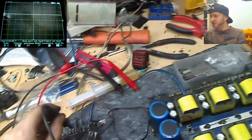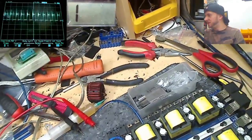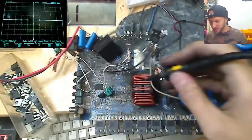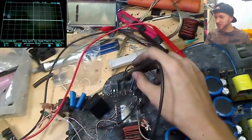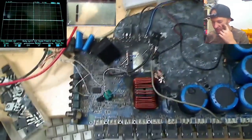Low side over here, amplifier coming on. Oh shit! It is switching! No way. It's very noisy over that side. I wonder why that is. Is that because there's no filter capacitor on that side perhaps? So with the speaker terminals connected together, oh shit, something burns. When the speaker terminals are connected together, something burns.